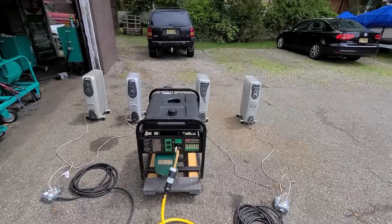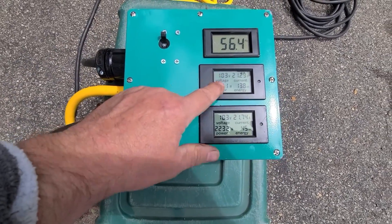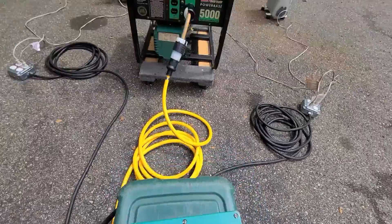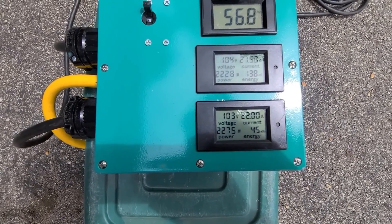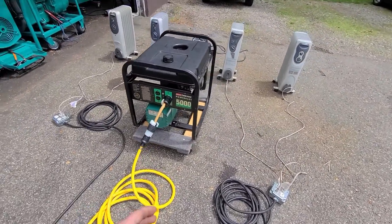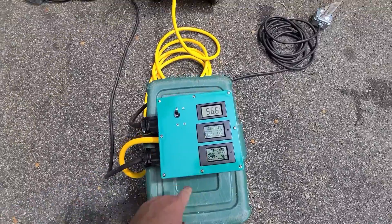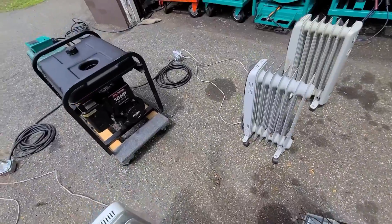I don't think this thing is going to make 5,000 watts. Let's do what we did before — totally unload it then bang it. I want to see smoke coming out of this thing. This is not acceptable — the voltage is not acceptable at full load. The motor is handling it, but the generator head is not delivering. Let me plug in the 500 watt light as well to push it even further and see where it's going to be.